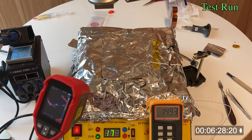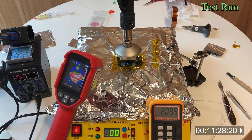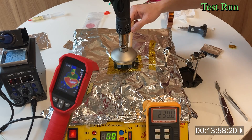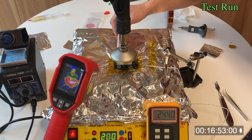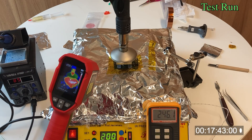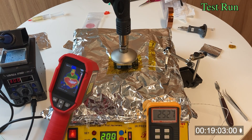This time, the motherboard temperature is quite close to the preheater temperature compared to my previous attempts. When the board reaches 160 degrees Celsius, I turned on the hot air station. According to my previous experience, the BGA solder joints melt at around 250 degrees Celsius. But I am curious if this new setup changes anything, so I nudged the RSX processor from time to time. It seems the solder joints won't melt below 250 degrees Celsius. After about 17 minutes, the temperature is very close to 250, so I get myself ready to remove the RSX processor.